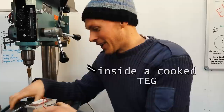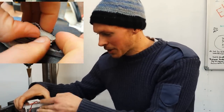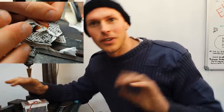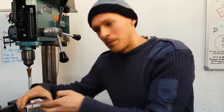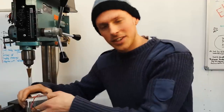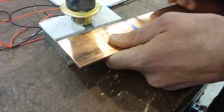So the solution is going to involve somehow reducing the temperature when the stove's too hot. One way would be to make a bigger riser which would dissipate more heat, but then you lose workability at low temperatures. Another possibility is to change this so that as it warms up and gets too hot, a gap appears between the riser and the bottom — and that's what we're working towards, to save our annoyingly fragile Peltiers.